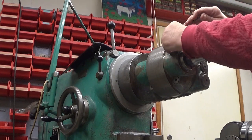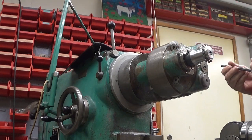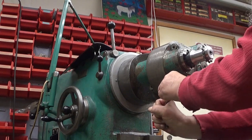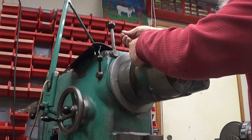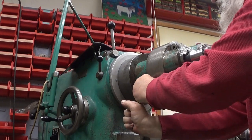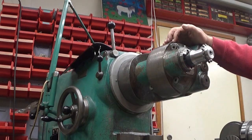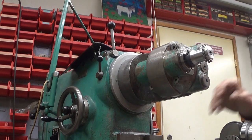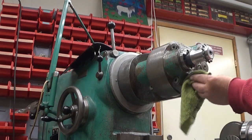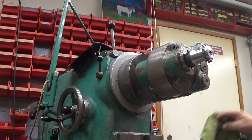And I will tighten these in place. Then retract the pin. I don't want it to be engaged here. And then the rest. These don't need to be really tight. They lock this quite permanently into place, and there is an additional support coming very soon. It's there. So the indexing is in 15 degree intervals, so it's very similar to indexing with the dividing head. So you can, and it's dripping oil, yeah. This has a habit of dripping oil every time I do this.